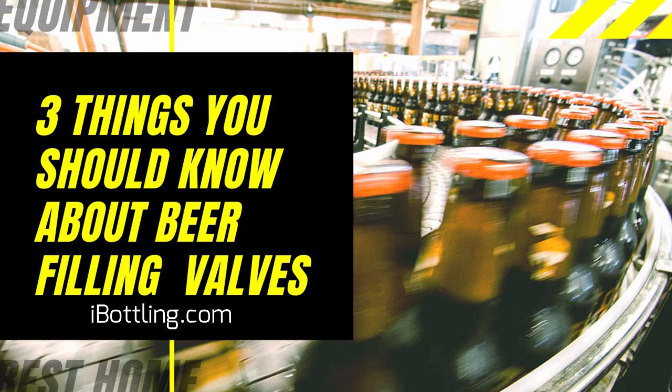It is an ideal filling valve in the aseptic filling of pure draft beer. Section 02: Comparison of Filling Machine Supporting Bottle Structure and Working Principle. By a separate feeding screw device, the bottles are supplied to the filling table in the required state, spacing, and speed. The bottle holding mechanism rises so that the bottle mouth and the filling head are in close contact for filling. After the filling process is completed, it is lowered and reset. The position of the filling valve remains unchanged; only the bottle holder rises and falls.